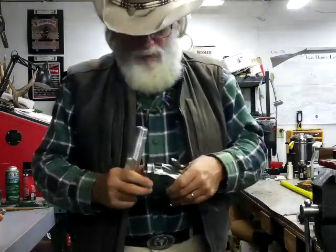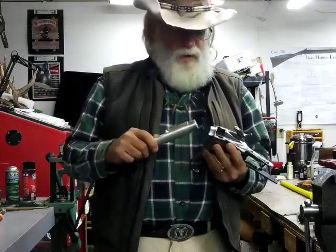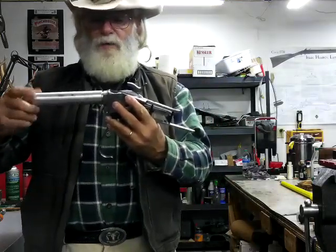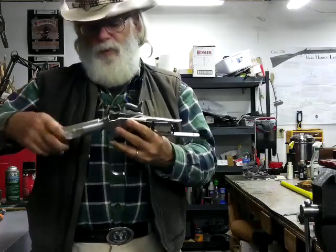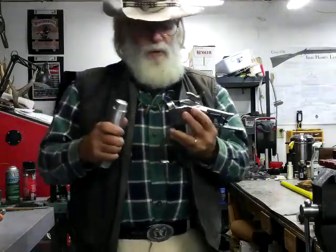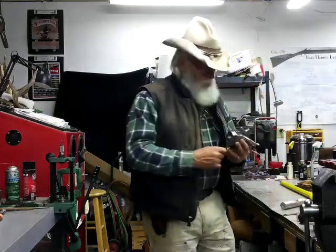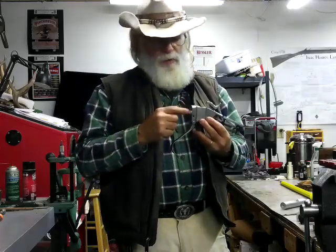This has a metric thread in it — they're square threads. On the last one I built, I made a test piece on an aluminum stub to make sure I had everything thread-wise the way I wanted it. I cut it out of aluminum because aluminum is easy to cut, and I'm checking it to make sure that these threads are what they say they are. You don't want to cut a barrel and then find out the threads are wrong. So I know the size of the thread, and we're going to have to turn the barrel stub down to the diameter we need here to thread it. When we turn it down, we're going to turn it down to a shoulder, and that shoulder is going to press against the face.